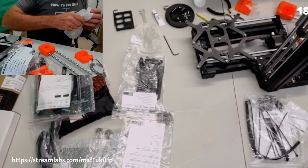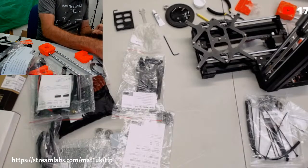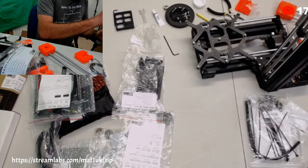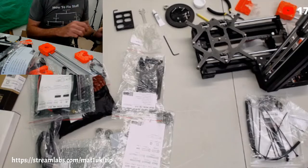Okay, so it's going to ask me to lube them. Yeah, well, we know to lube them because it's the same way we did before, isn't it? You slide it in, you click it. Position the bearing so you can see the 2 rows of balls like in the picture, with a permanent marker on the outer surface of the bearings. Oh, I see. Right, so you just want a line on the top. So let's get them lubed up.